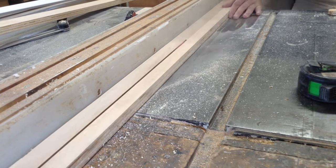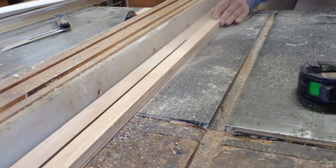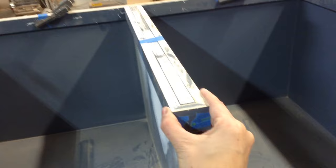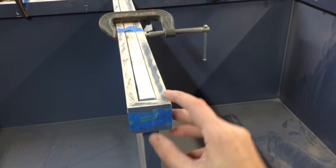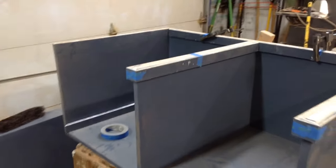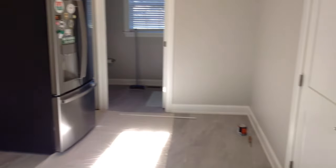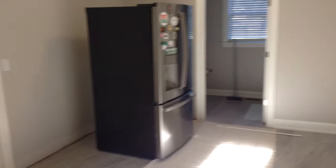This is getting some trim ready for install. The top doesn't meet the ceiling so they wanted a flat top, and I cut angled pieces on the table saw so there's no gap between the crown and the top of the cabinet. The base trim is flat with no detailing, so I bought flat trim and cut it into inch-and-a-half strips. I pre-cut all the trim before taking it to the customer's house, but didn't permanently attach it because the levelness of the floor will require adjustment.